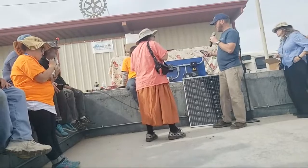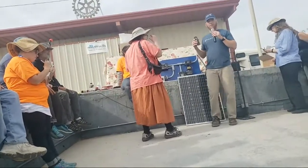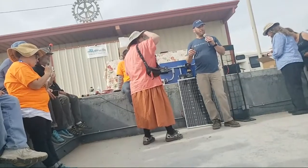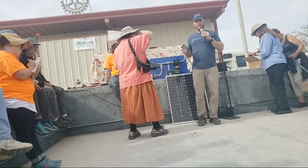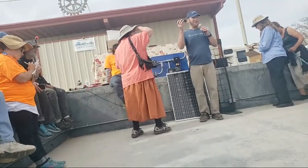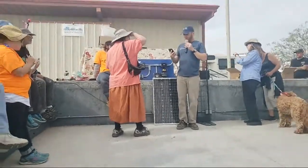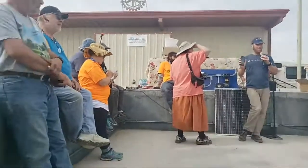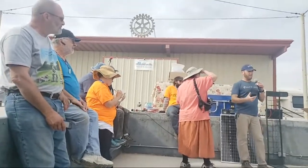State of charge information just won't be available for this demonstration because in order to tell the state of charge of your batteries, the controller first has to have the battery get into float mode. It's gotta be full. It can't tell you how much water is in the bucket until you fill the bucket all the way, and then it can count the water in and out of the bucket, right? So I don't have percentage full yet because my battery just hasn't had a chance to get fully charged.